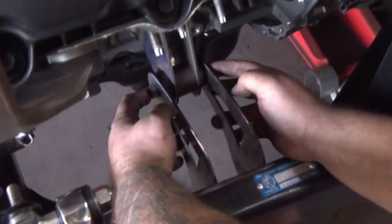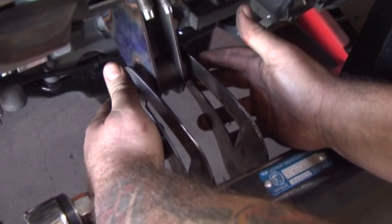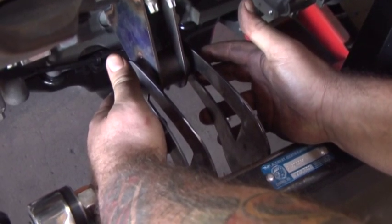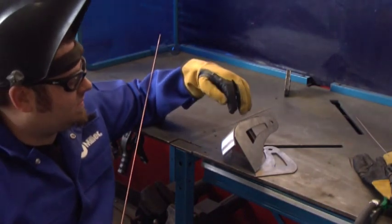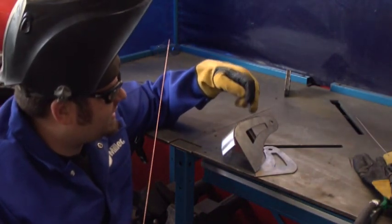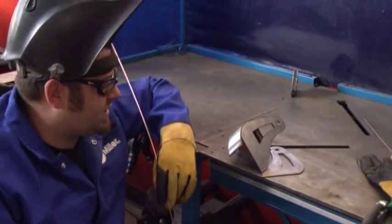The next thing we're going to do is bend the plate to cap the top and the bottom, weld that up, and weld these on — and you've got some finished motor mounts. I've got my top boxing plate bent in and set up here to weld. I've got a nice edge-to-edge setup so there's a nice gap to weld in. We can tack this thing together.